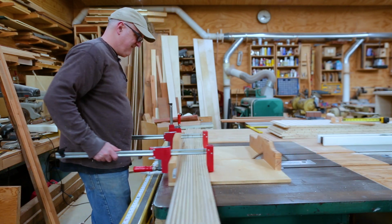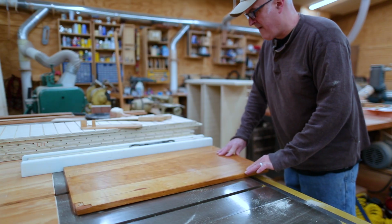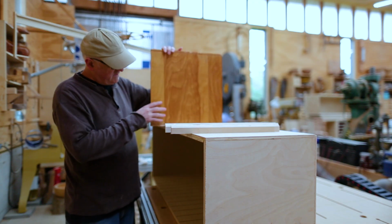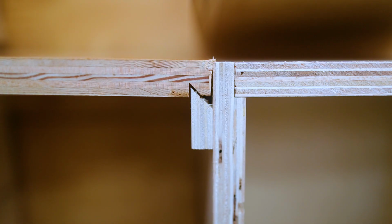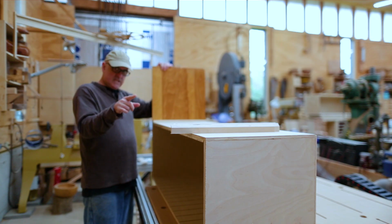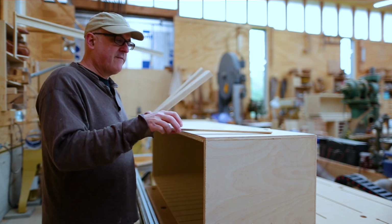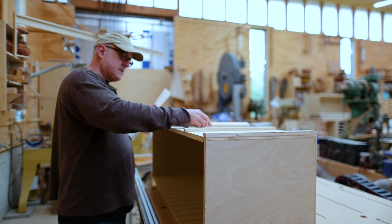And I made one shelf spacer piece to go between the boxes, which helped me figure out the location for the cleats, as I wanted the top shelf to be flush with the top of the boxes. In cutting out my spacer piece, I figured out where the top cleat needs to go to make that flush at the top. And what I figured out is the bottom of this top cleat needs to be 46¼ inches from the bottom. So I can then divide that by 5 and get 6 cleats. And if I divide that by 5, I get 9¼ inches, which was kind of nice that I got a somewhat round number.